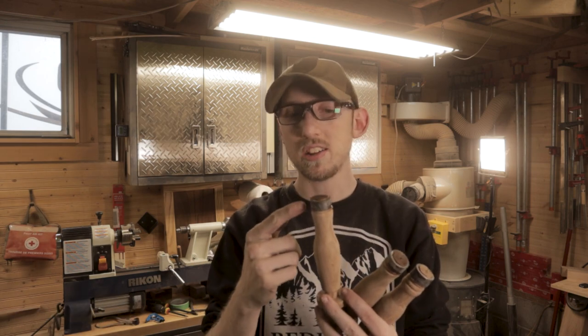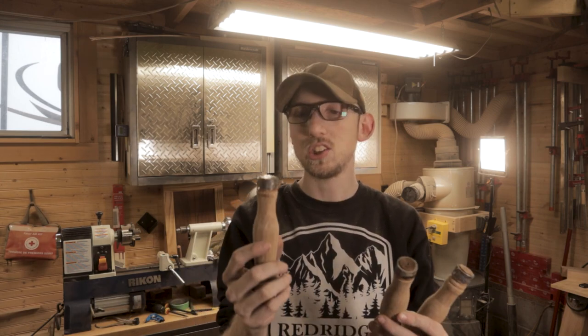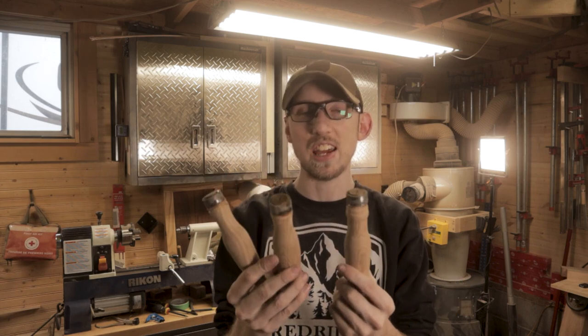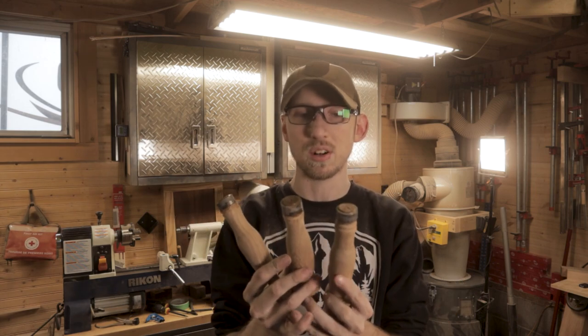So as you guys saw, all I did to make this is just take a section of black pipe, the same as I use on all my pipe clamps back there, hacked off a little section using a hacksaw, and then used my 1x30 grinder to help clean things up a little bit, square up the edges. Then I just used some epoxy to fasten them on. So now what we can go through and do is all of our finished sanding and cleanup before we start adding in some of our final details here.